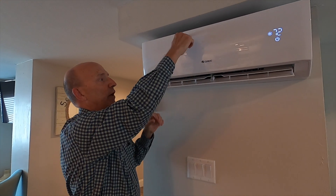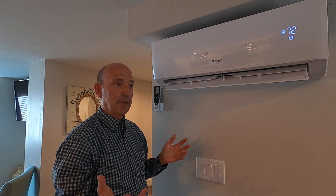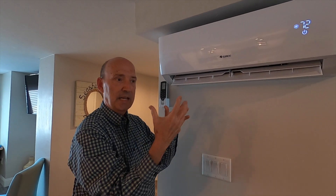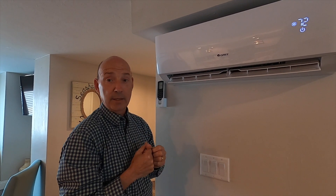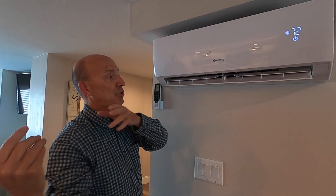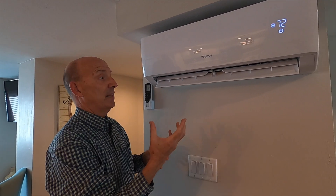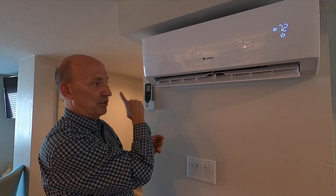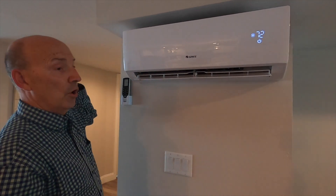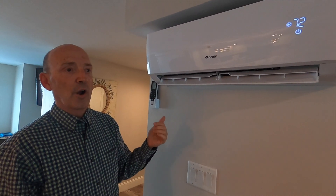The air then goes through a cooling coil where, in the summertime, we absorb heat out of the air — when we make the air less hot, it's cool. We run air through the filter, through this coil, and discharge it back into the room. That heat is absorbed into the refrigerant circulating through the system. There are refrigerant lines on the back side of this wall going outside to the condensing unit.